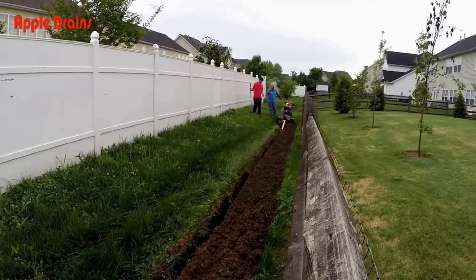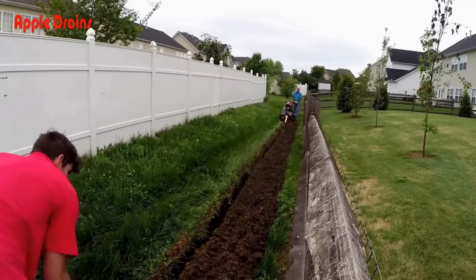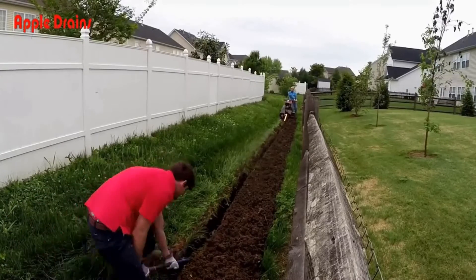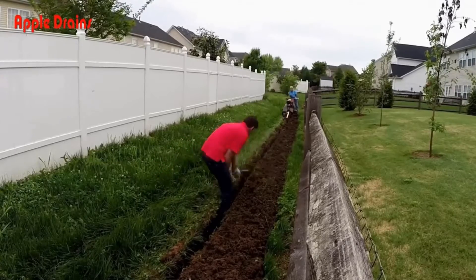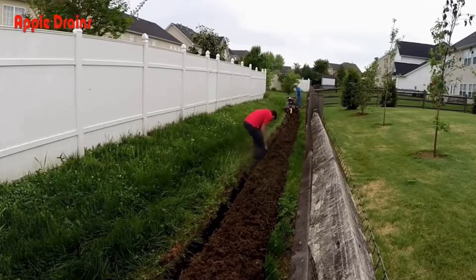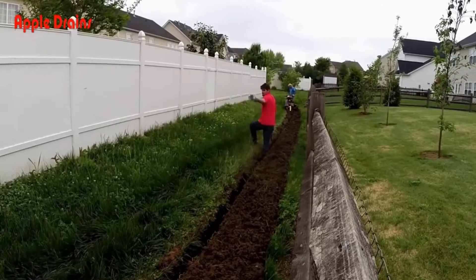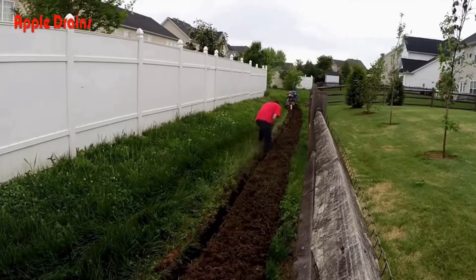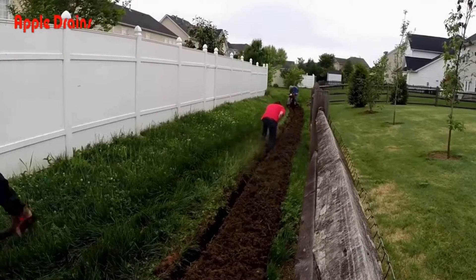You need a trench to collect the water that's pooling up in your backyard. The French drain collects the subsurface water — water that's in the ground itself. You can also add a couple of catch basins to collect the surface water, so when it rains hard in that low spot in your yard, those catch basins will collect the water. Remember, it's always two things in every drainage system: collection and discharge. This is the discharge of the French drain, going over to a storm drain.